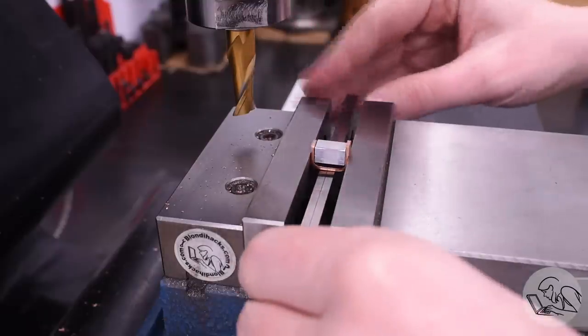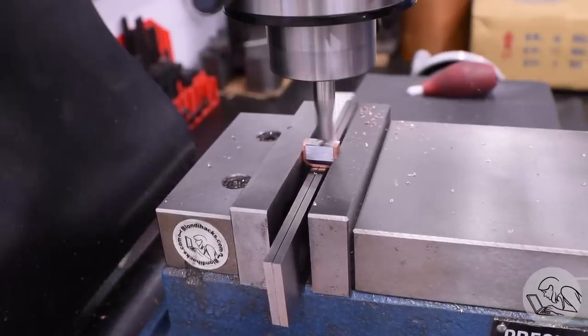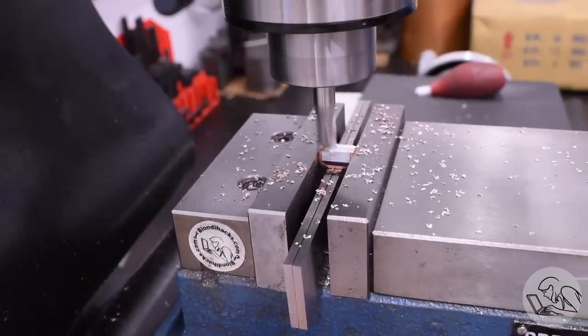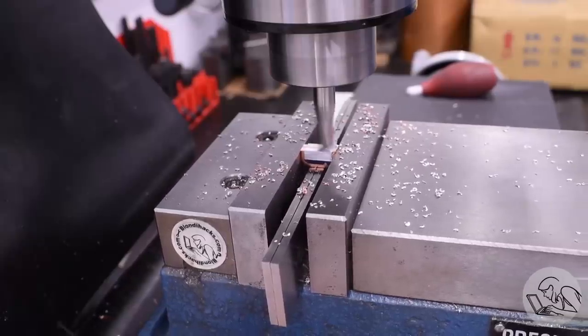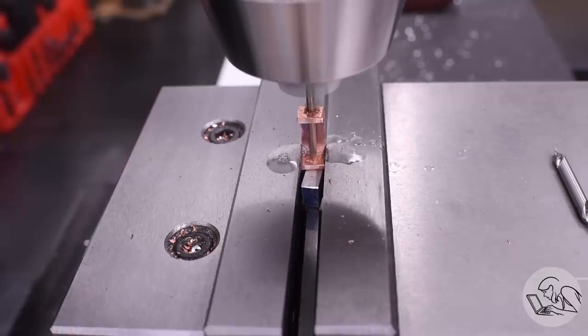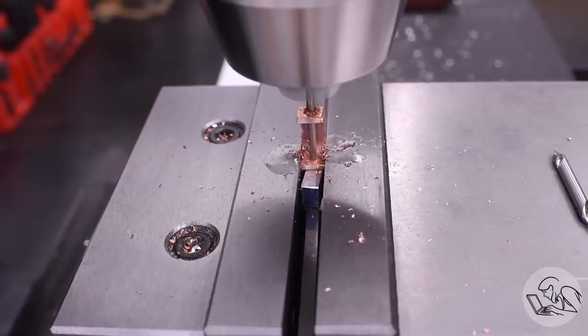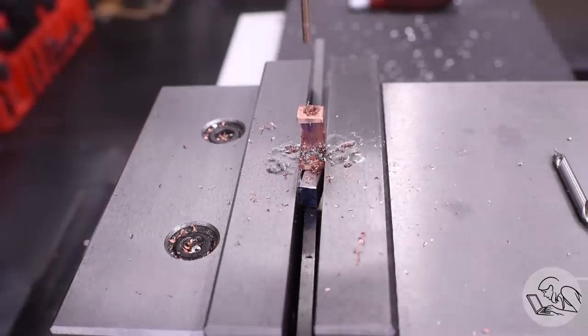By putting both bends in the middle of the piece, then you don't have to try and figure out how much material is consumed by the bend, which in sheet metal work can be pretty complicated. Then that little block served double duty to support the part for cross-drilling the hinge holes as well. For the bottom hole, I used the top hole as a guide just to make sure that they remain aligned rather than trying to drill all the way through the aluminum, which would have been difficult and prone to mistakes with a tiny drill like this.